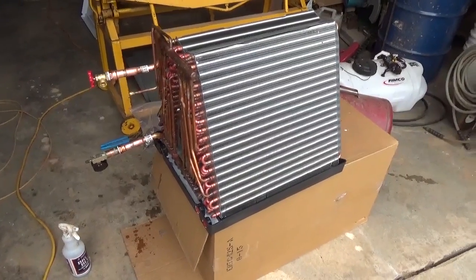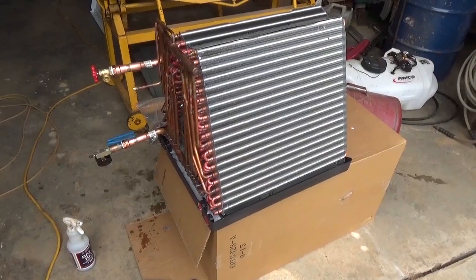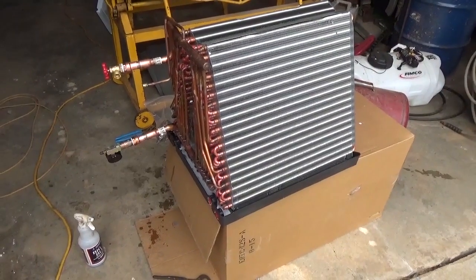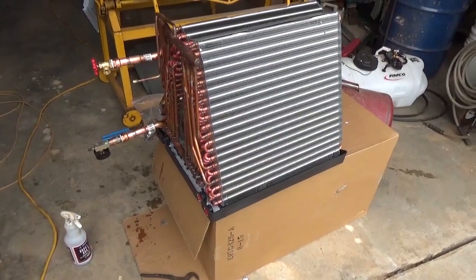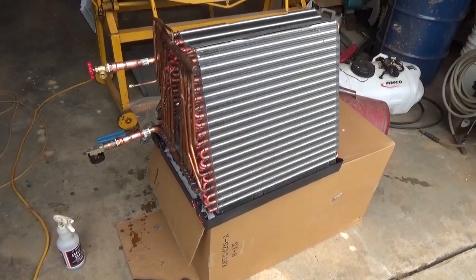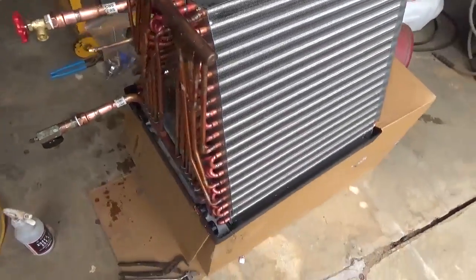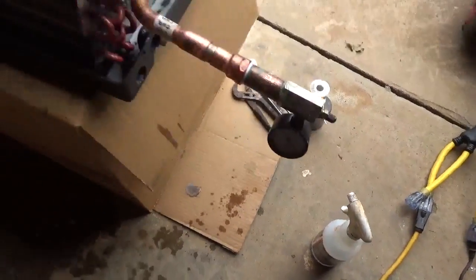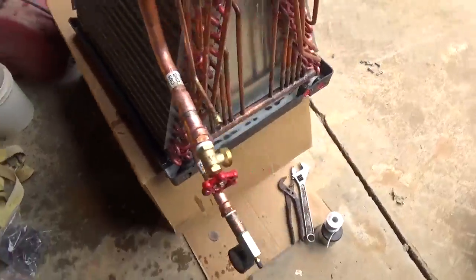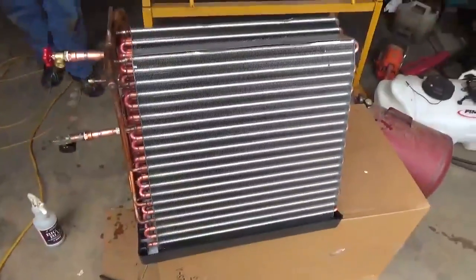As we switch over to water, we're going to replace the A-coil in my air handler with a five-ton hydronic A-coil. It fits pretty close in the air handler but we're going to have to do a little bit of sheet metal work. This coil actually came out of a damaged unit that fell off a truck, so before we go through all this work we're pressure testing it to make sure there are no leaks. So far so good, and there's room, so we're going to go ahead and put this one in place — no more refrigerant in the house, that's the goal.